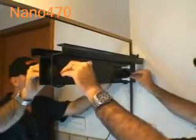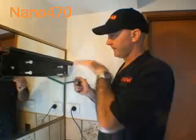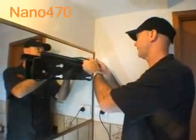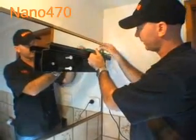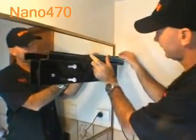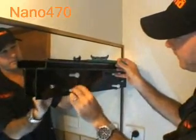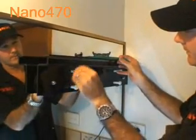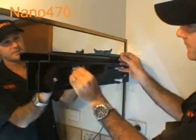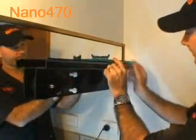So we're just going to push a little bit hard. Be careful not to push too hard, you're working on glass here. Double check. If we've got our light square level this way, we're going to level it the other way using our shelf. Just going to place it on and putting our level on top of the glass. Now it's pretty level as we speak here, so everything is in tune. Just going to wind these stabilising bolts up so that they're just touching the glass. What that's going to do is stop the light square from any kind of movement.